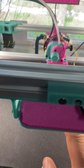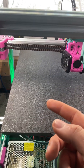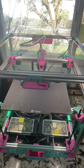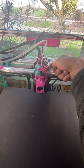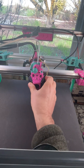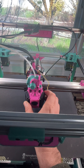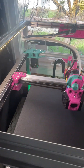There are two ways to test for racking. The first way is to put your tool head in the middle, then take one finger and just push in the back and pull it forward. If you see your tool head going side to side — a zigzag coming in and going back out — or if it just keeps going like this, you're racked.